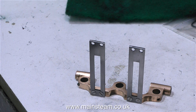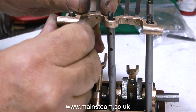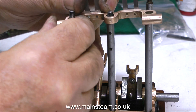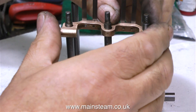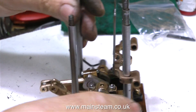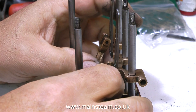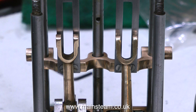With a wave of my magic wand they're the right way round now — and in more ways than one. By making this mistake I figured out that there was a wrong way round to start with. Initially when I looked at this as a unit, the countersinks were on the wrong side at the top. So as I've reassembled these crosshead guides I've actually turned them round, because the countersinks are on both sides at the bottom, and now the countersinks at the top are in the right place. When I offer up the connecting rods to the crosshead guides, as you can see here, they're in the correct position. So that's the crosshead guides and the motion bracket in place.